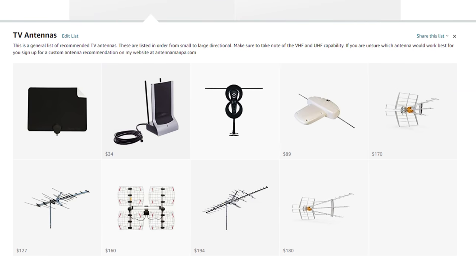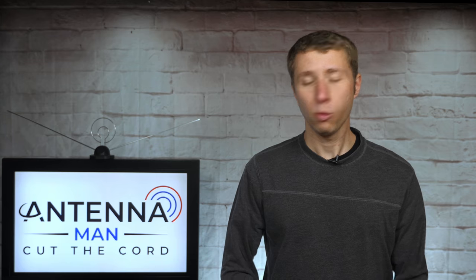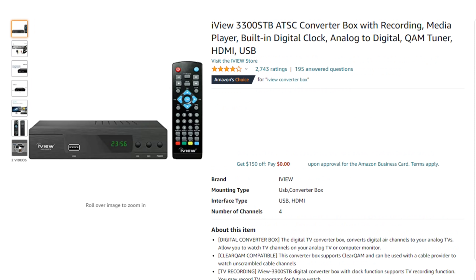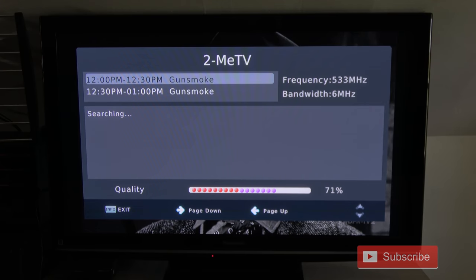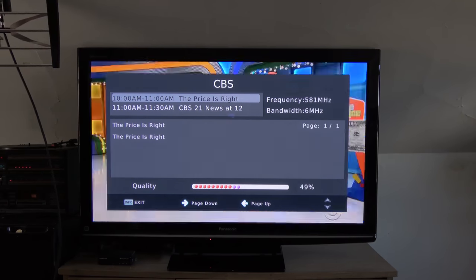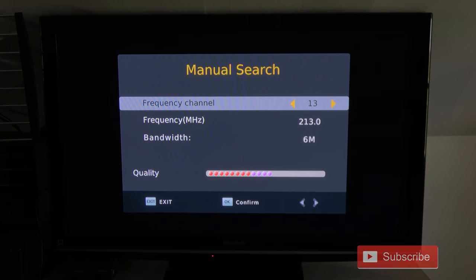If you're looking for a decent indoor antenna, I include a link to a list of recommended antennas in the description of the video. With any indoor antenna setup, it's critical to use some kind of signal meter as a guide to find the best location for it. Moving an antenna as little as a few feet can have a huge impact on reception. If you plan on using an indoor antenna, I highly recommend the MediaSonic or iView digital converter box. Both have a signal meter that comes up if you press the info button twice, which is very helpful to find the best spot. I include a link to both models along with an instructional video for the MediaSonic DTV box in the description.